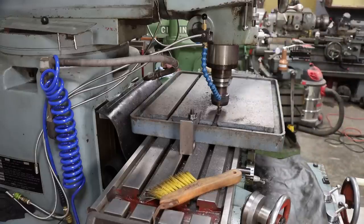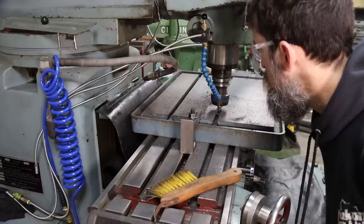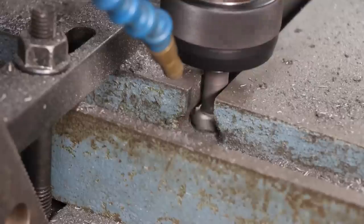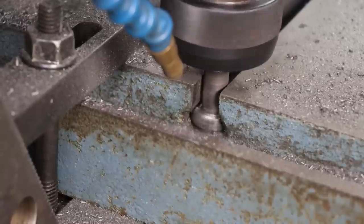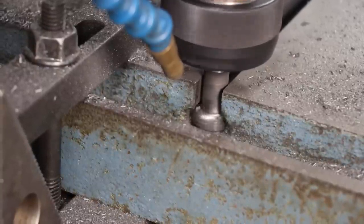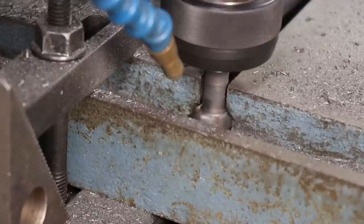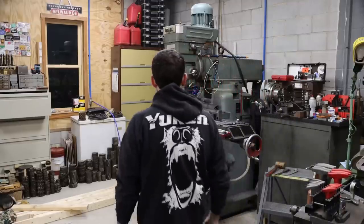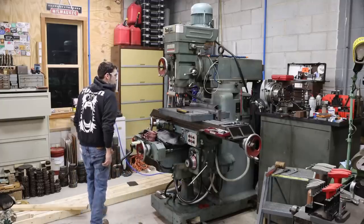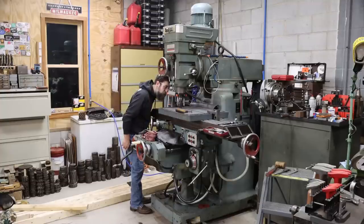She don't sound too healthy. So when you're cutting cast iron and it sounds like kind of like this, that's good. You know, not anything out of the ordinary, nice hiss noise. But when you're cutting cast iron with a high-speed end mill and it starts sounding like this, you get a glass-hard area of cast iron, and that is the gasping last breath of whatever end mill you were running on it. Unless it's carbide, you've lost some edges.